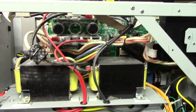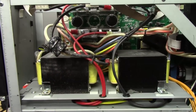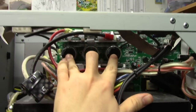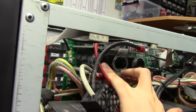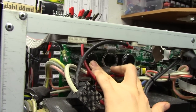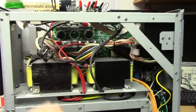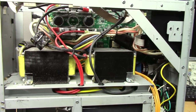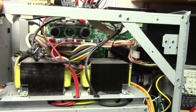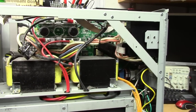Beyond that, though, it seems to be pretty true to the spirit of the Smart UPS brand. Well, it's still got the two giant transformers running at 50 Hz. Some big damn caps sitting in there, those are just giant 75 volt 1500 microfarads. And of course, as all of these units, it runs on 48 volts, so I can run four of my giant 170 amp hour power safe batteries with this thing and just keep on chugging forever.